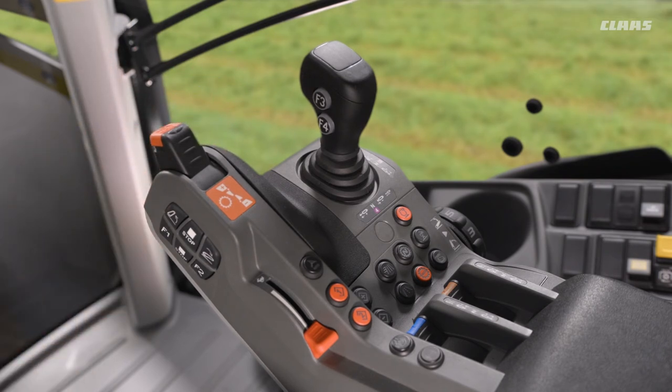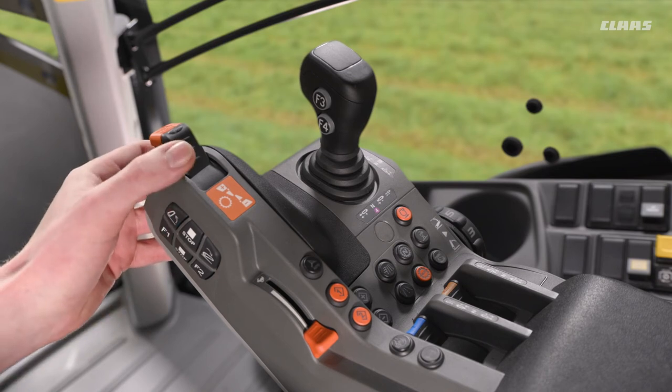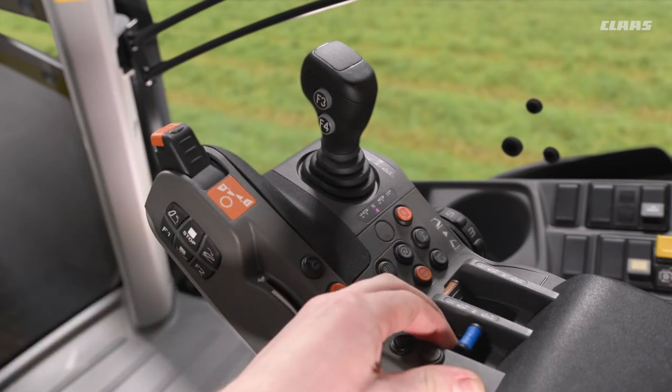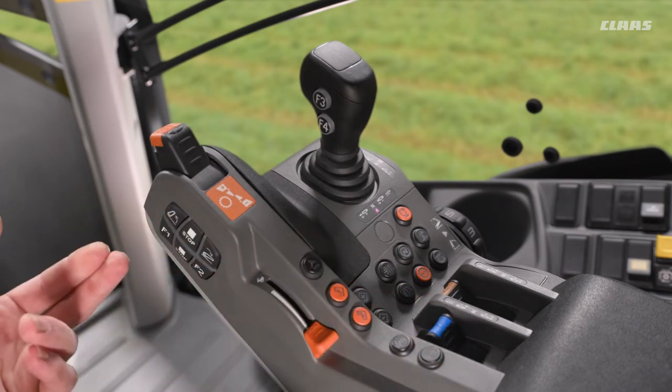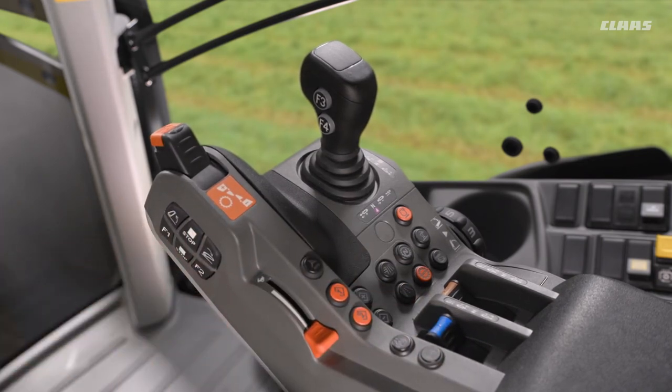The next thing we would then do is carry out our sequence normally, so completely manually. So for example, maybe I lift my linkage up, I increase my gear by 2, I then pump my blue spool valve in the positive direction. Once I've done that, the next thing I would then do is press my stop button that we have here on the lateral side of the armrest. This would tell the machine that we've now finished recording our sequence.